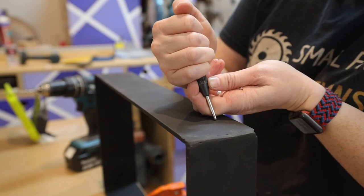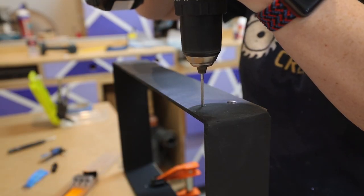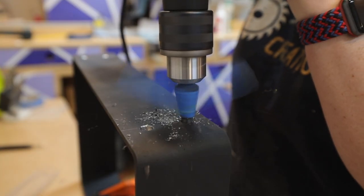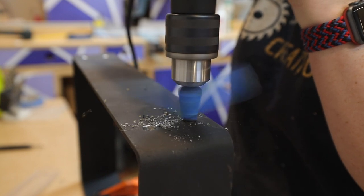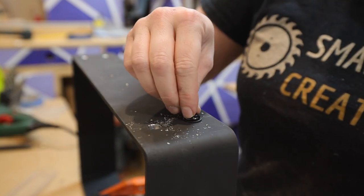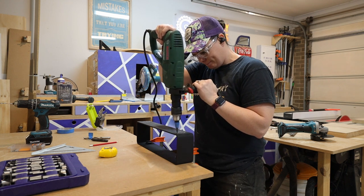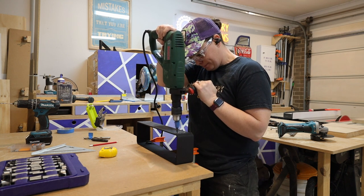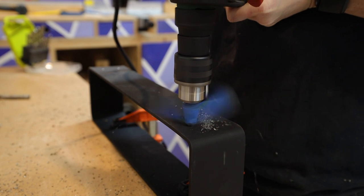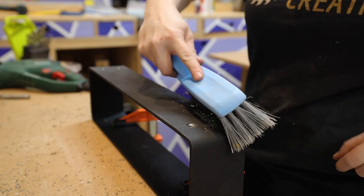I took measurements of both ends of the bracket to ensure they were the same and then matched that measurement to the timber. With the bottom sections all cut I can now drill the holes in the metal brackets to prepare them to be fitted to the unit. This is the first time I've used a step metal drill bit but it was very easy and it worked great to drill the 12mm hole I needed. I used a power drill so that I had enough juice and didn't burn out my regular drill. The step drill bit has a tendency to move around when first starting off, so I used a smaller 3mm drill bit to get the hole started and create a divot to stop the bigger bit from moving around.